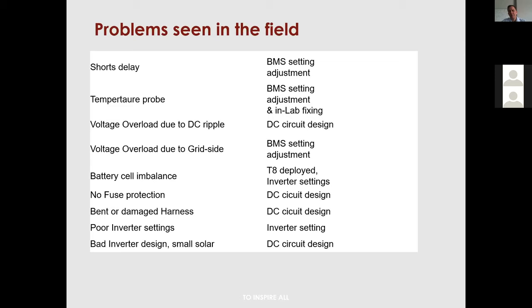A common problem occurs when the system is installed in a cabinet — closing the cabinet door folds the cables at the zero-volt ports into a 90-degree bend, breaking the tiny internal wires. I solved this once by pushing the batteries through the back and pulling the cabinet slightly off the wall by about an inch, giving enough space to close the door without impacting the harnesses.